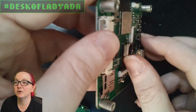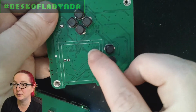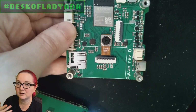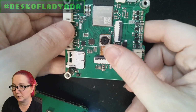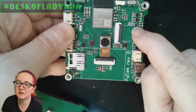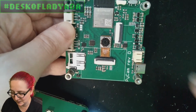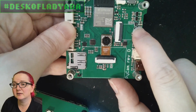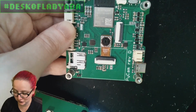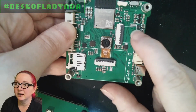The camera modules, you'll notice this one's metal, and you stick it on, and I try to heat sink a little bit through the ground plane on the back. But when it's running and streaming the preview image, it can draw like 200 milliamps. And so I also replaced the 3.3 volt LDO with a little buck converter, and I'm using the TPS, whatever the one I have in the shop, the TPS629 or something. It's a 2 amp, 1 megahertz buck converter, and it's very cheap, only like 20 cents. We covered it on a previous great search for sure. And then the 1.5 and 2.8 volt regulator.